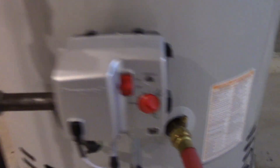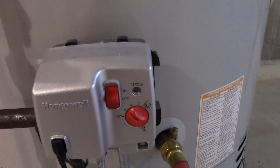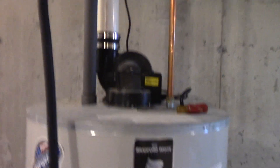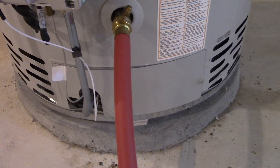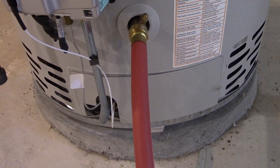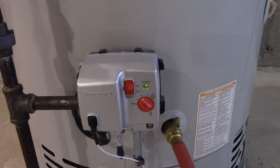So if you have an electric water heater, turn the breaker back on. On this particular gas one, we're going to reopen the valve. And I'm first going to turn the thermostat back to where it was, and simply turn this on. Momentarily it should start. There it goes — this particular model is a power vent. And momentarily we should hear the burner turn on. And we have ignition — just heard it turn on. And if you have a standing pilot water heater, turn the knob on the top back to on, set the thermostat, and it should kick right on. If you turned off the pilot, you will have to relight that.